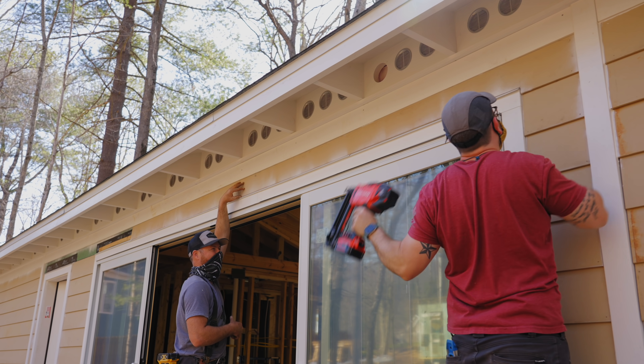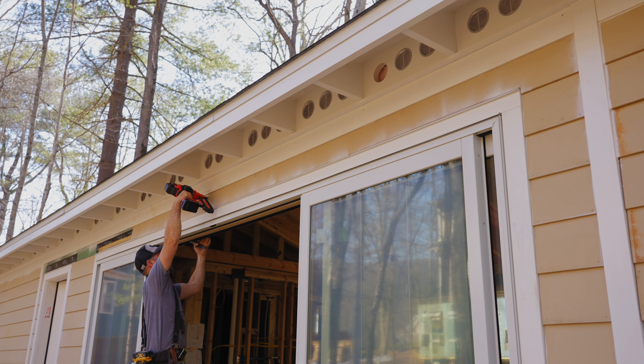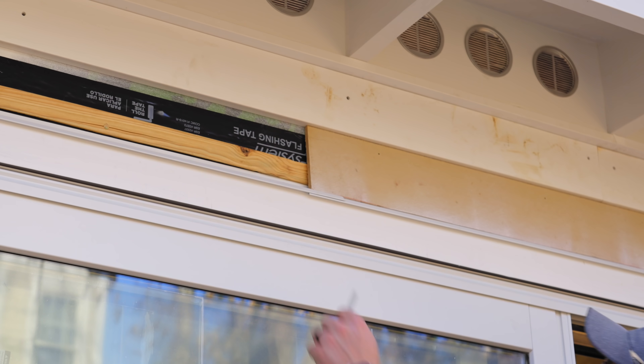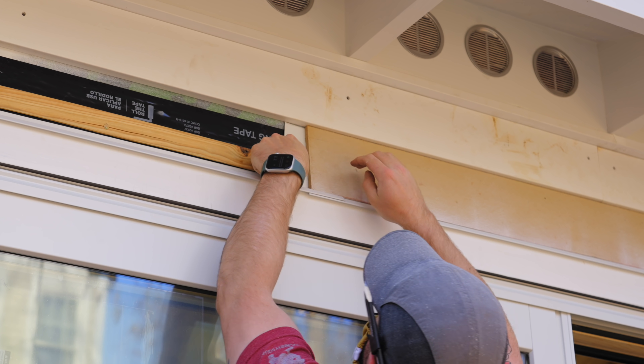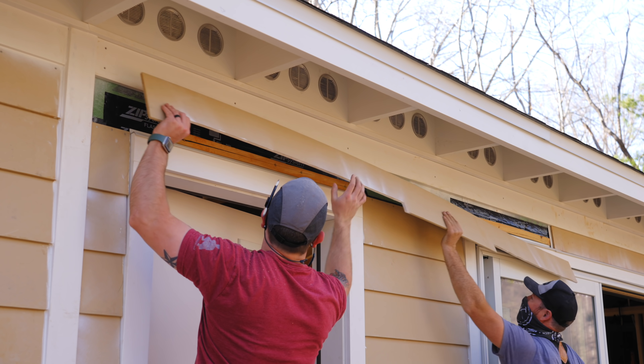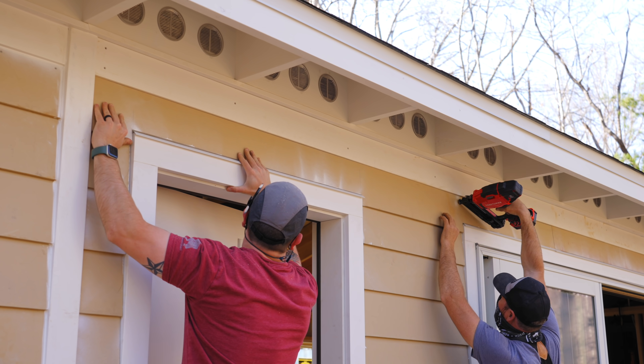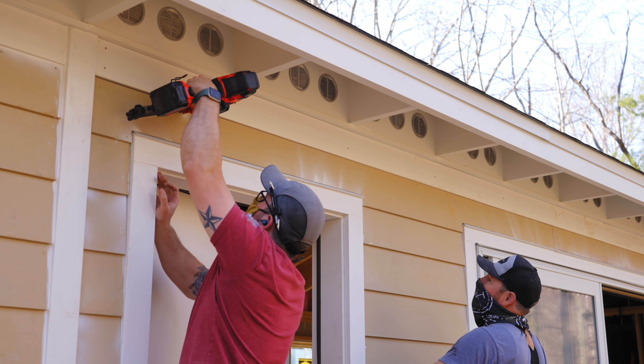We also went ahead and installed those last couple of pieces of upper trim on the front section and then got those last pieces of siding installed above the doors. We needed to add another strip above the door to maintain the same angle across where that piece of siding ran above the doors, using ripped-down pieces of treated material. We only had one butt joint on this entire house — right above the large sliding door — and it was super simple to flash: I cut an off cut of flashing and tucked it behind where those two pieces of siding met, so any water that works its way into that seam gets pushed down onto the flashing.